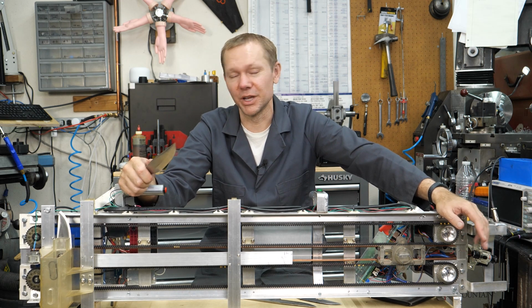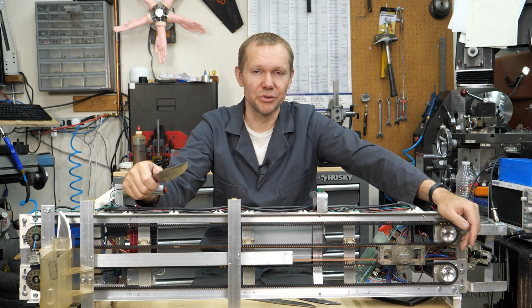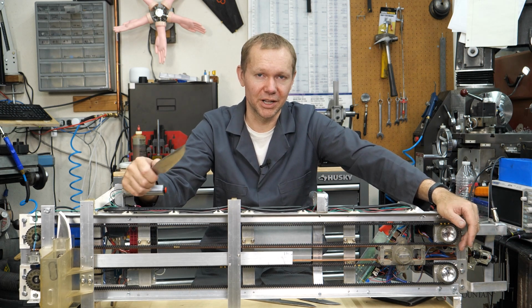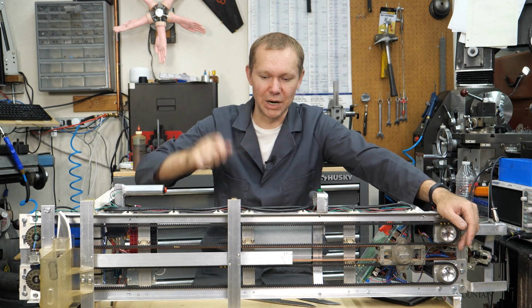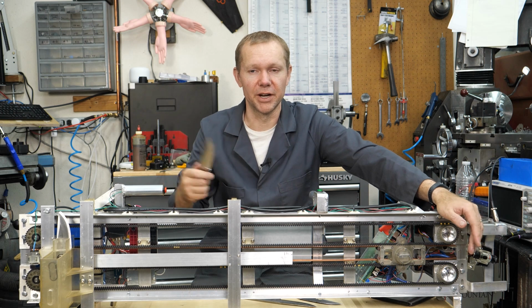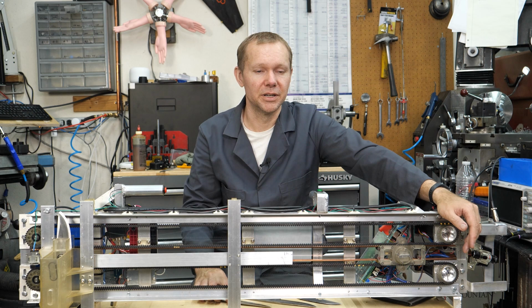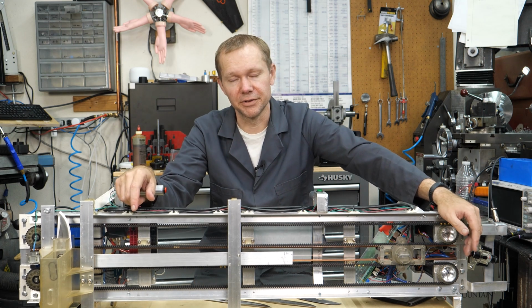And so we ended up going for the mild steel, and it didn't have the problem. You could just turn the power off to that electromagnet, and it would just drop the piece of mild steel. If it was heavy enough, it would drop it just fine. And the weight of one of these mild steel knives was no problem falling off of there.